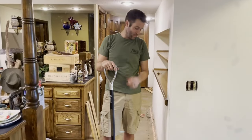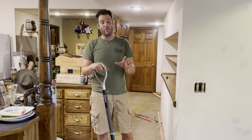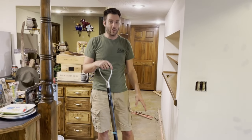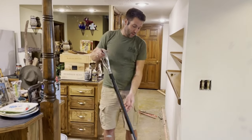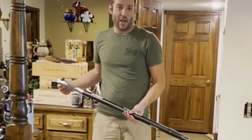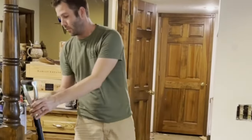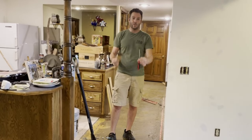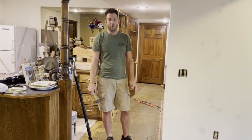This is going to be a real fun project — removing tack strip. If this was in a wood floor it's a lot easier to do, but when these are shot into or hammered into concrete it becomes a little more difficult. Most people don't have a floor scraper at home, so I'm going to show you an easy way to remove the tack strip from the concrete floor using nothing but a flathead screwdriver and a hammer, and it actually cleans up real nice and doesn't leave a lot of debris.